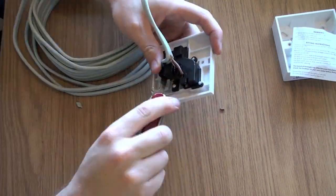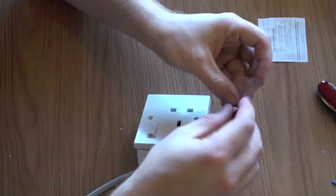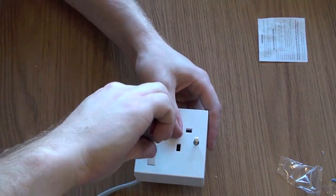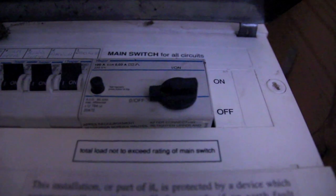Growing in the loft, it's very dark and I need to use artificial lights, so I'm wiring this little plug socket. Safety first — I'm going to turn off the circuit I'm working on, and also to be safe, I'm going to turn off the main switch for the entire house.